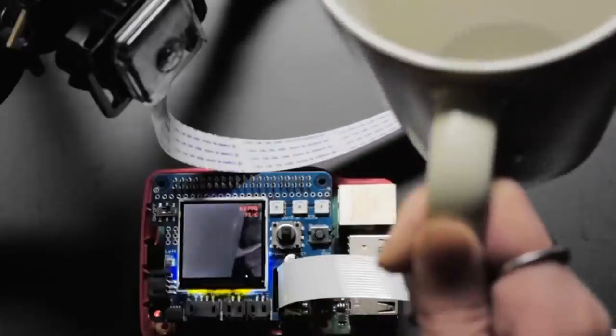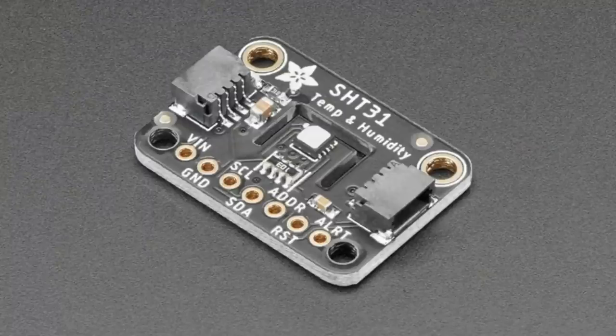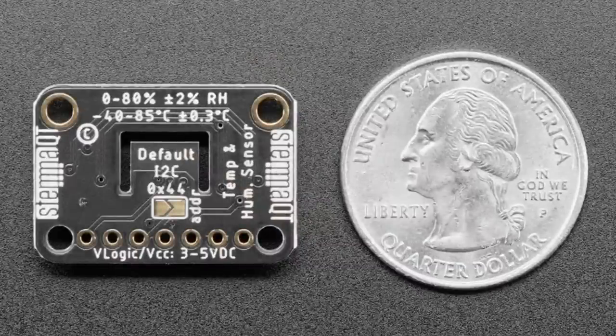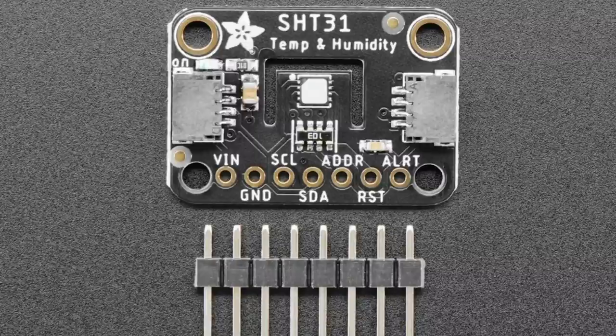You can experiment with the free Microsoft Lobe system for programming your own custom AI models. The SHT31 is a popular temperature and humidity sensor from Sensirion, and we now have it in STEMMA QT format. Same as before but now in our standard pinout order and physical shape, with a little cutout to keep it isolated. The SHT31 still has its protective Teflon cover — it's a great sensor — and we have Python, Arduino, and CircuitPython code for it. Now it's plug-and-play; you can even plug it into that I²C Mini we showed earlier.